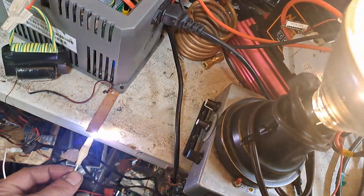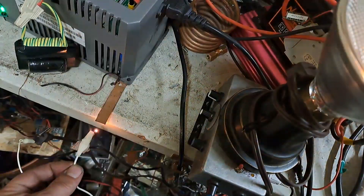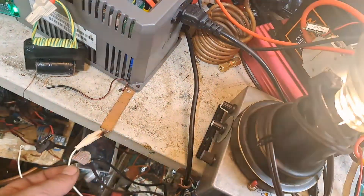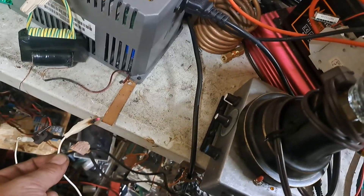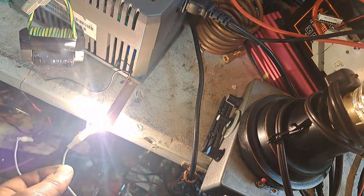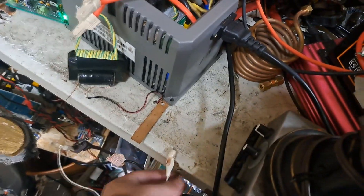Let me pull a little arc with the light bulb still in the circuit. It's not pulling too much yet - bring it up a little bit more. I can hear a little hum. Still less than five amps - a ZVS driver could do this pretty easily. I'm able to do this at higher voltage with obviously less amps. That's only about 30 VAC. I might try to see how big of an arc I can pull off this, though I'll need to get some better probes or terminals set up.